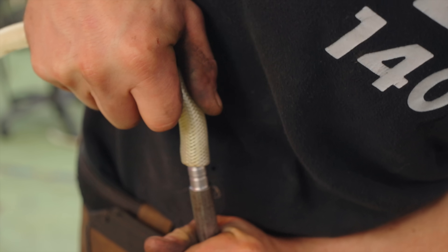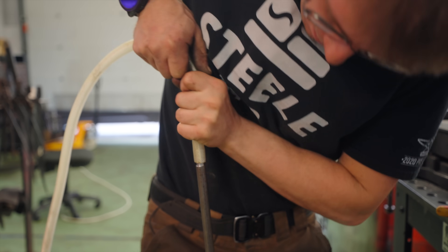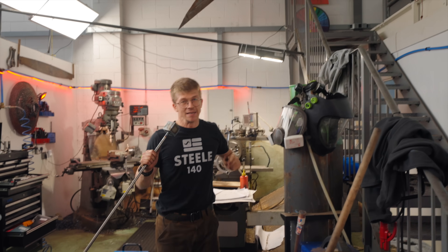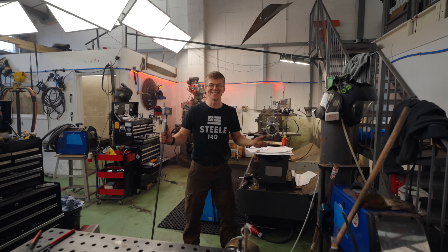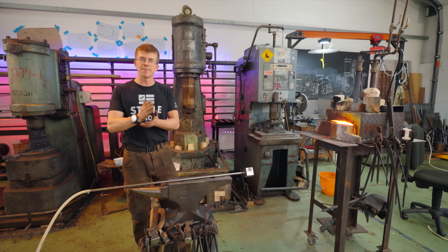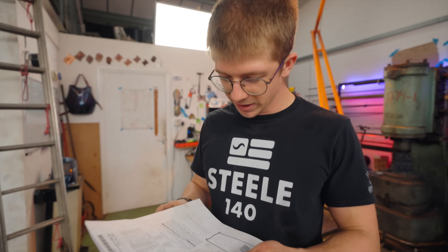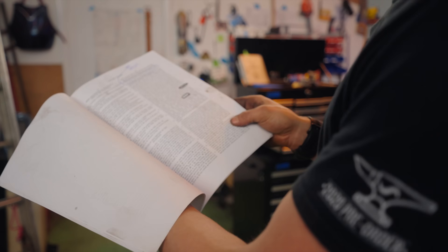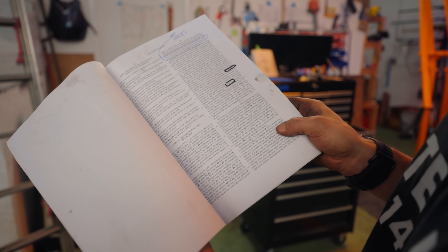Now we turn on the gas and adjust the flow rate. Argon is inert — it doesn't explode. Before this goes in the fire, a very important consideration is at what temperature we're going to forge weld this titanium together. Something tells me the answer is going to be relatively vague — why would you give away all of your trade secrets if you didn't have to? The patent says an inert gas is pumped in at a selected rate sufficient to displace all nitrogen and oxygen, at a slow rate — but how do you define a slow rate? These are the vaguenesses that mean there is a feel and an art to making titanium Damascus that clearly took a long time to refine.